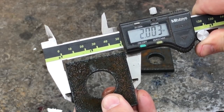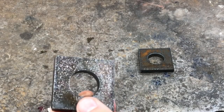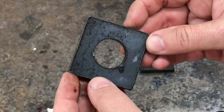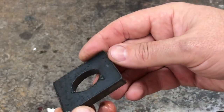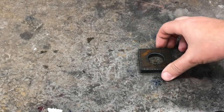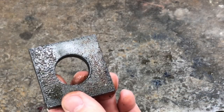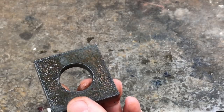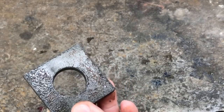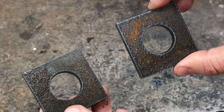This one's really square too — two to three thousandths over. Overall, the True Cut machine on a regular cut does a really nice job. Just off the table with a tiny bit of dross, the edges are really square and straight. If you're not trying for perfection that's fine, but when you're getting parts within two or three thousandths on a plasma table with draft and dross, you're doing good — you've got a good machine. Let me know what you think.